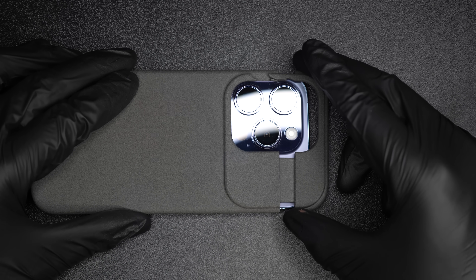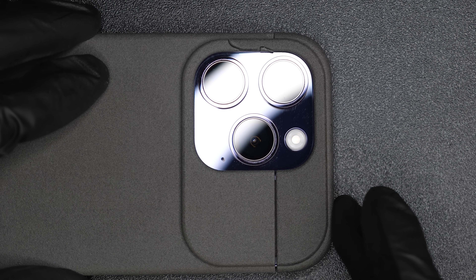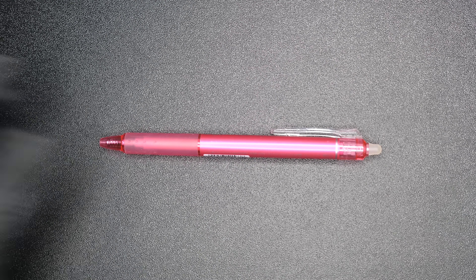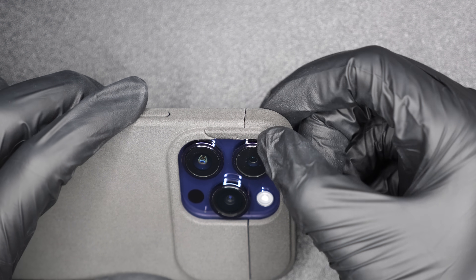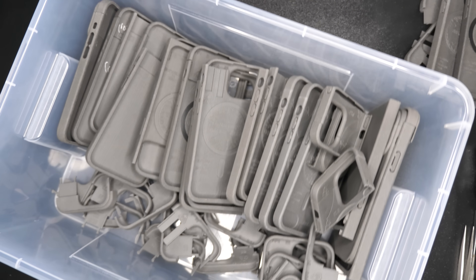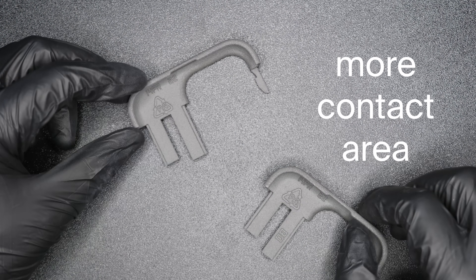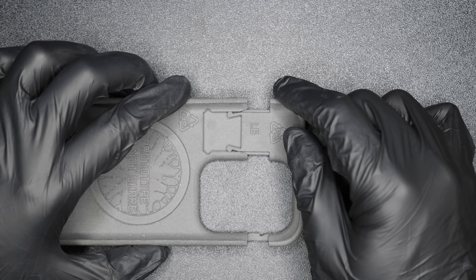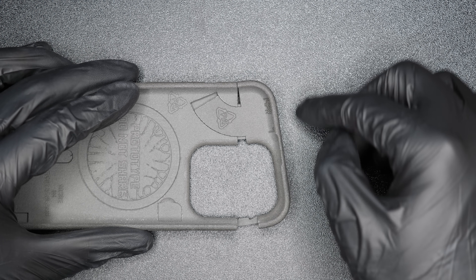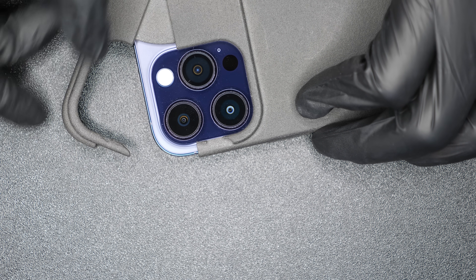It's not trivial to make tiny 3D printed parts click together, and even less so when you want them to last for years. I was kind of inspired by the latching mechanism in a pen and tried something like that. It worked well on the latch side, but the other side had too much play — not acceptable. And so here we go into another weeks-long rabbit hole. I ran lots of tolerance tests — wasn't reliable enough. Then I had a buckle belt-inspired design — not durable enough. And finally, the rotating joint design. I'm really proud of it. No play. I keep the latch on the other side too. Just listen to that.